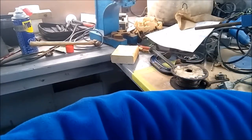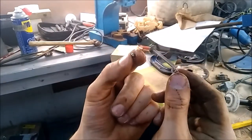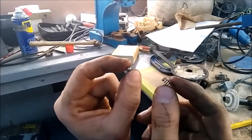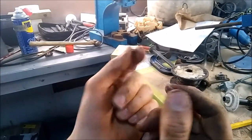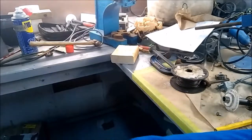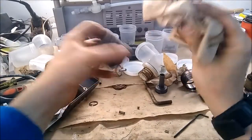Here you can see the little ball bearing with a spring behind it. I'm just holding it with my finger and pulling this piece out, then dumping the ball bearing and spring. For reassembly: ball bearing and spring — it's a standard little ball bearing; if you lose this it's just a detent so anything that'll work for the size will do, and there's a little spring.